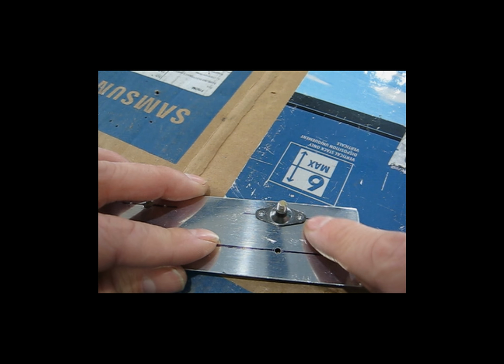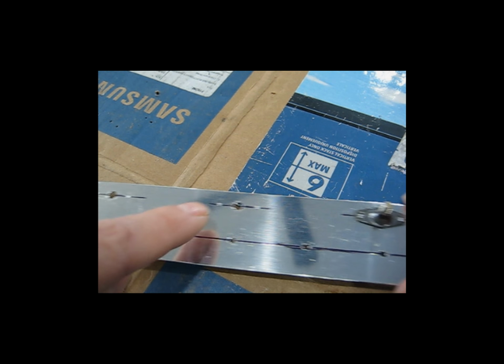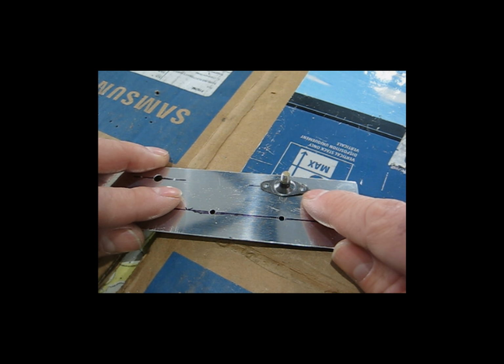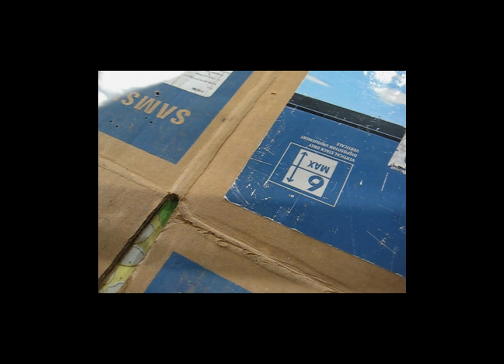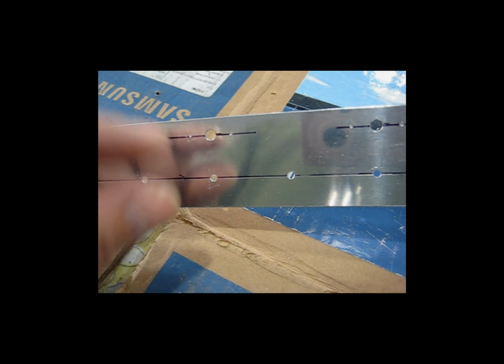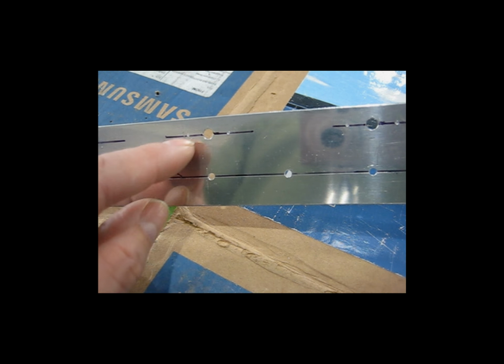And also, you start running a drill bit through these holes in the nut plate. When you start doing multiple locations, these holes in the nut plate are going to get bigger and bigger, and they start to get an odd shape, and they may elongate. So by the time you get down to your last few holes, you may have a lot of movement, a lot of chatter. You know, the holes in the nut plate are bigger than they need to be,